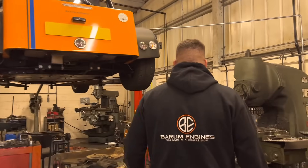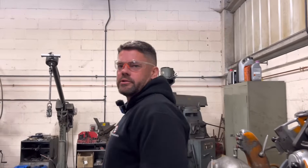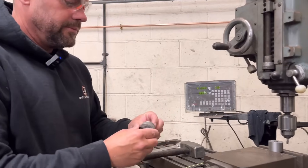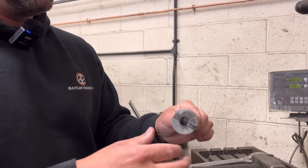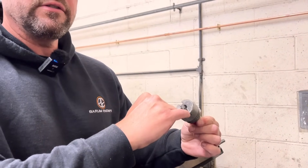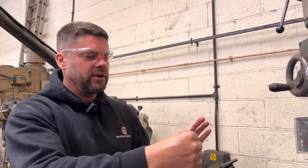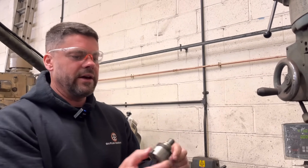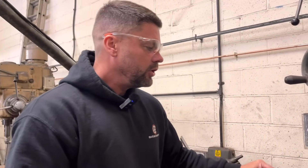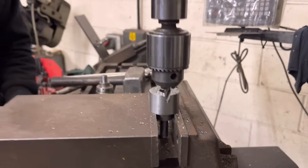So you've got a crank to balance for a Lotus. Yes, a Lotus. The driver we've got isn't too good — this is a driver out of something else. You can see we've got a 5/16ths by 8.5mm deep slot, so that fits on our machine. That will screw into the thread on the end of the crank that holds the pulley on. John has turned one up today for the Lotus — a better fitting one, because the other one was terrible.